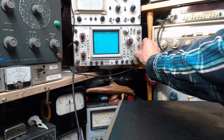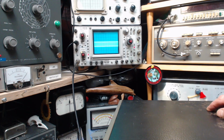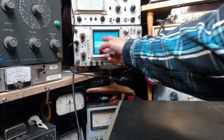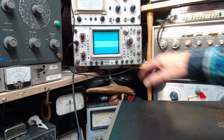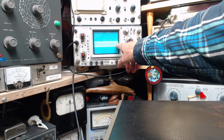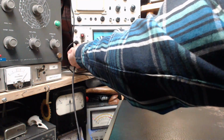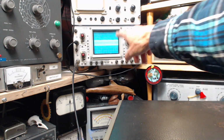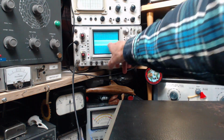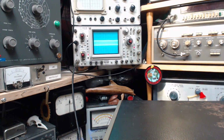I guess it's just a triggering setting. Yeah, triggering settings off. So it looks a little like there's two lines here, but there isn't. There's a usual looking band to my eye. High frequency band in here. If I just position this right on a line, it's exactly two. Peak to peak voltage here, according to this, is 20 millivolts, peak to peak.